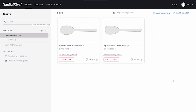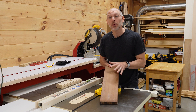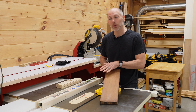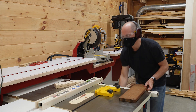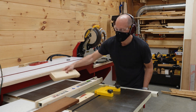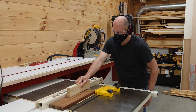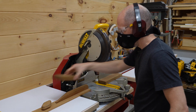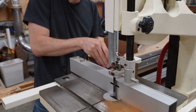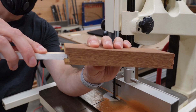While we waited for the parts to arrive, we started working on the die block and the punch. To make the die, I'm going to use this piece of 5-quarter Ipe. It's an incredibly dense species of wood, and because of that I'm not going to try and cut through it all at once at the table saw. I'll make multiple passes and raise the blade each time. This species produces a ton of really fine dust, so please wear a mask and protect your lungs. I need two matching pieces for the upper and lower die plates, so I cut them to length at the miter saw, then take them over to the band saw to nibble away a groove to hold the pieces down to the CNC table.